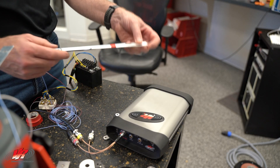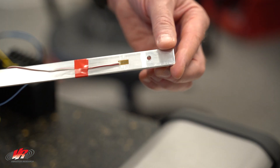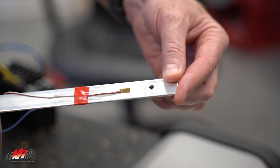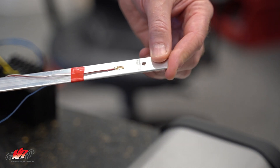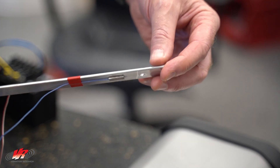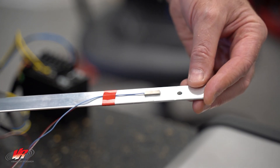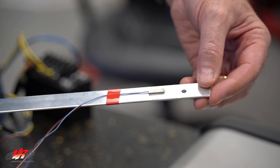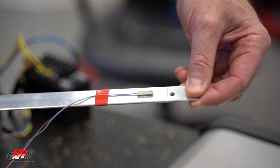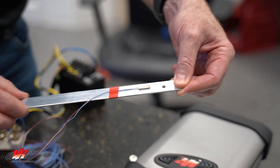We have here an aluminum cantilever beam. On one side we have mounted a traditional foil strain gauge — labor intensive, with lots of setup involving Wheatstone bridges, amplifiers, and signal conditioning. On the other side we have a piezoelectric reusable strain gauge which plugs directly into our Observer 1000, adhered to the aluminum beam with superglue, similar to what we would use with an accelerometer.